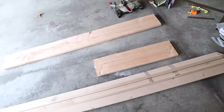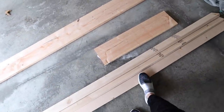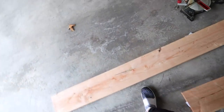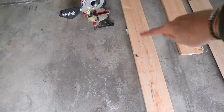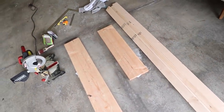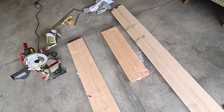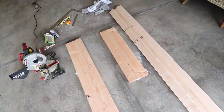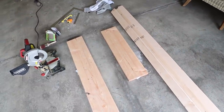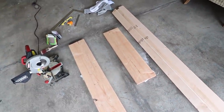What I'm going to do is get all my cuts made. These are going to be 27 and a half inches — this one's already cut. Then I want to get all the staples pulled out of this side, all of these sanded down, and then I want to get them stained and dried. So by the time my brackets come, I can start building the actual table. So just going to get cuts made, staples pulled, and sanding done. And then we'll talk about staining.